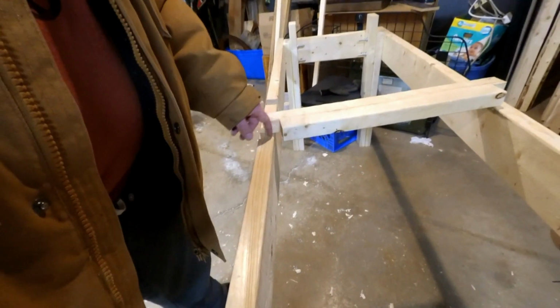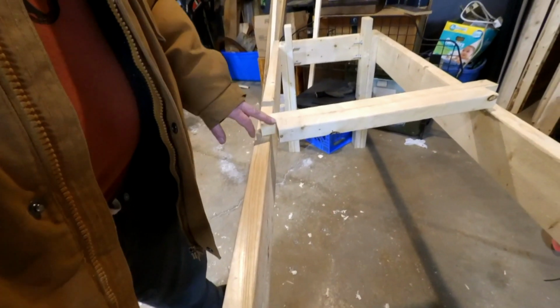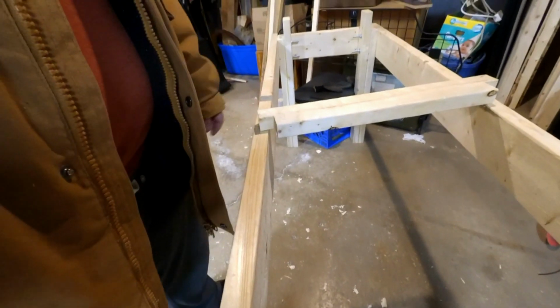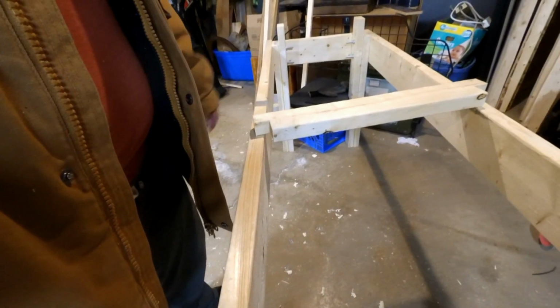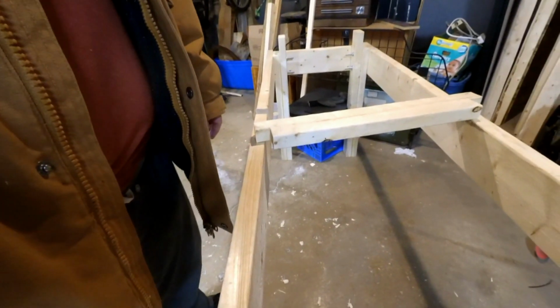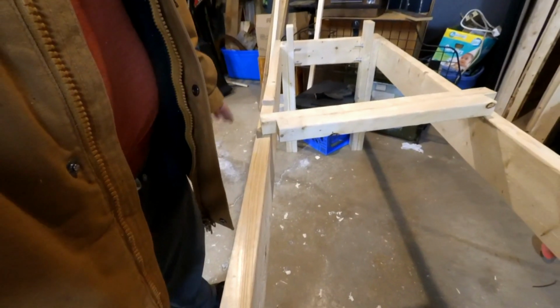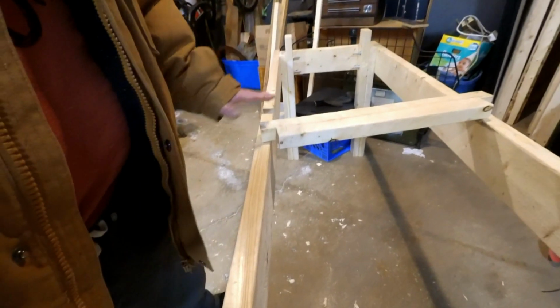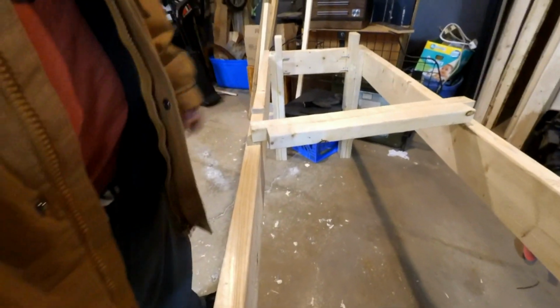So mostly table saw this out, chamfer my edges in a little bit just to keep this from all crackling out when I jam it in there. And gonna construction goop this like a liquid nail or No More Nail or whatever those brand names are. We're gonna do that. And smash this in about as level to the apron as we can.